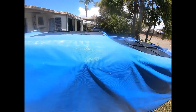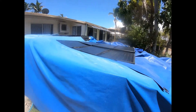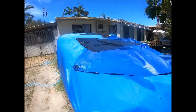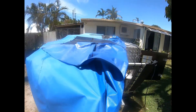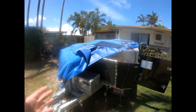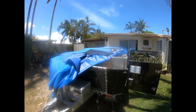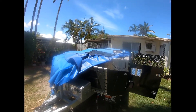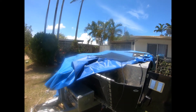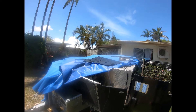I'll just leave that on for a while — it'll be sunny for a couple of hours, then the trees will probably put shade on it. I previously had a 250 watt aluminium and glass panel but it was just too heavy, so I stick to these two blankets now, giving me 400 watts — 200 each. You'll never get maximum efficiency of course; heat, foliage, and voltage drop on cables are all factors. But you do expect around 200 watts of power — that's P equals I times V, power equals current times volts.